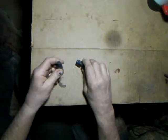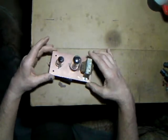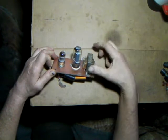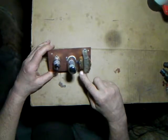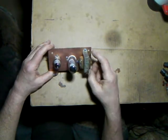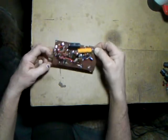The Greenlee punch works really slick in aluminum and copper clad circuit board. For the chassis, I built up an audio amp that uses a 12AX7 for preamp and a 6V6 audio output tube. The output transformer I found on eBay is a line matching transformer - if you get the right taps it sounds really good, giving you about 10 watts of audio output. I've even run music through it and it sounds great.